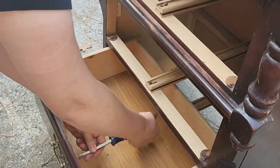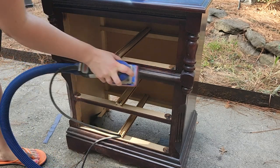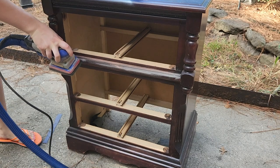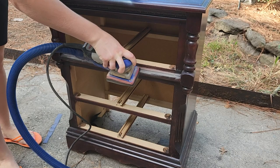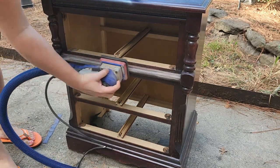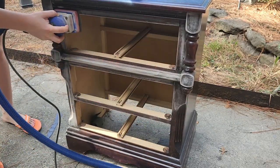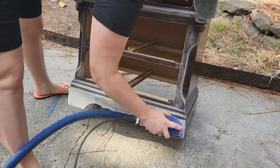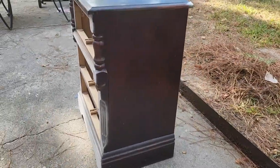This piece I picked up from an auction and it was in bad shape. I definitely needed to sand it before I painted it. I'm using my Surf Prep sander — I'll have the link down below — because it has a really nice padded attachment, and this nightstand has a ton of curves. I definitely needed a padded sander or else it would mess up all those beautiful curves.